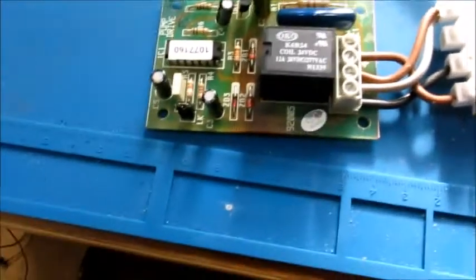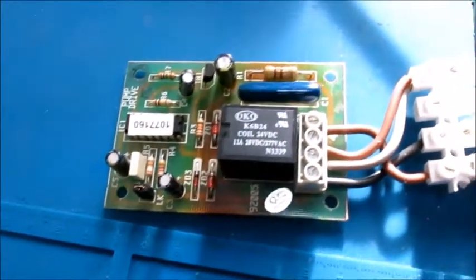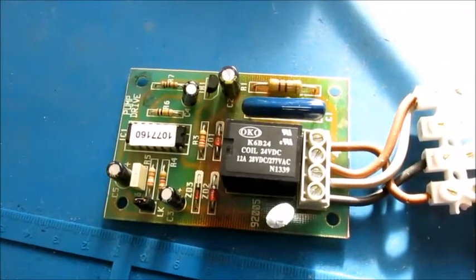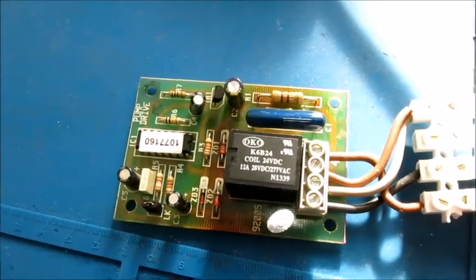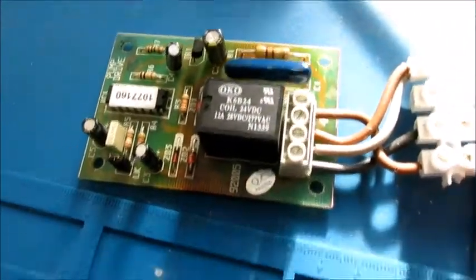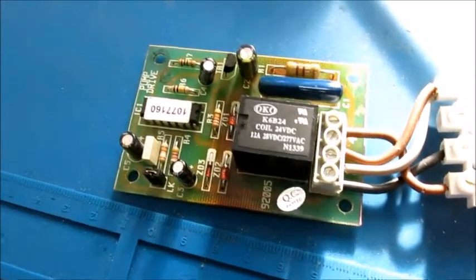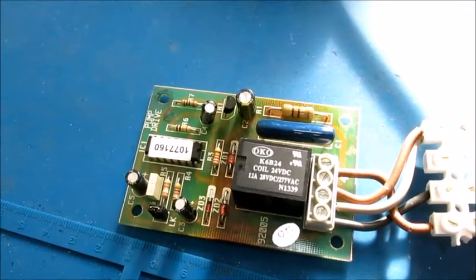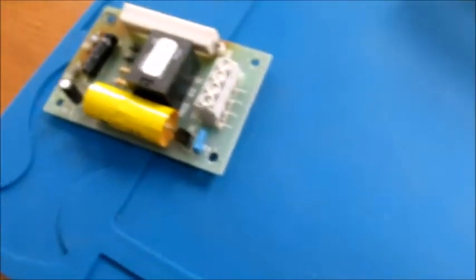Okay, so this is the pump drive PCB. As I say, this is designed so that when the central heating pump's not being used very much, through the summer or whatever, this will periodically power the system on, and it will just exercise the pump for a few seconds, just to keep it clear of any blockages. Because quite often, if the pump's not used through the summer, come the first time you want heating in the winter, the pump's stuck and the system won't work. And you get people suggesting tapping it with hammers and all sorts of things. But this is a clever idea to get round that. And this can also buzz. Symptomatic of this would be the buzzing occurring when the central heating's running, as opposed to the pump delay timer, which will just buzz whenever the boiler is on and the circulating pump for the boiler's running. So pretty much every occasion the boiler's on.